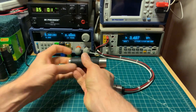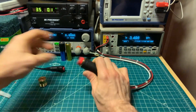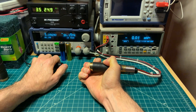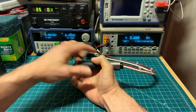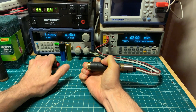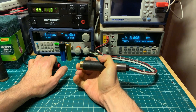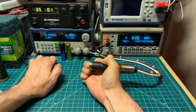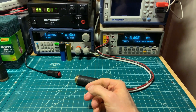We're going to move on to brass. That was 46 millivolts — 0.046 — about eight times better than stainless steel. Readings of 0.042, 0.042, 0.042, 0.047, 0.035, 0.040. I'm going to take something in the middle: 0.039.